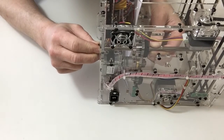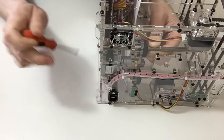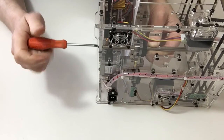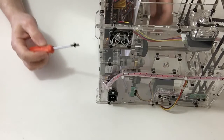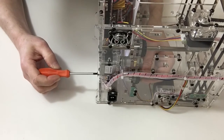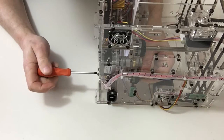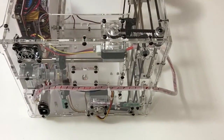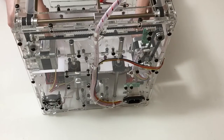Line that up and carefully do those up, then move the table up and down so that we've got proper alignment and the table is moving up and down freely. Then do that last one, place it in position, turn it back up, and test the table by bringing it up to the top.